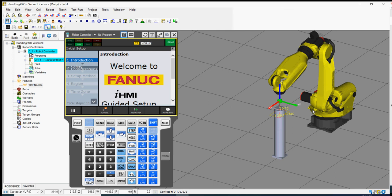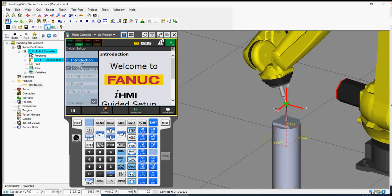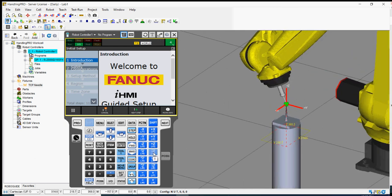Now let us rotate this about our axis number 4. We're going to move this about axis number 4 to get it to the second position that we have to put it in for our lab. So let's try moving axis number 4. Let's increase the speed, maybe about 5. Now let's try it. You can see my axis number 4 is rotating about that point. We're going to get it close to about 90 degrees because that's what the picture shows.